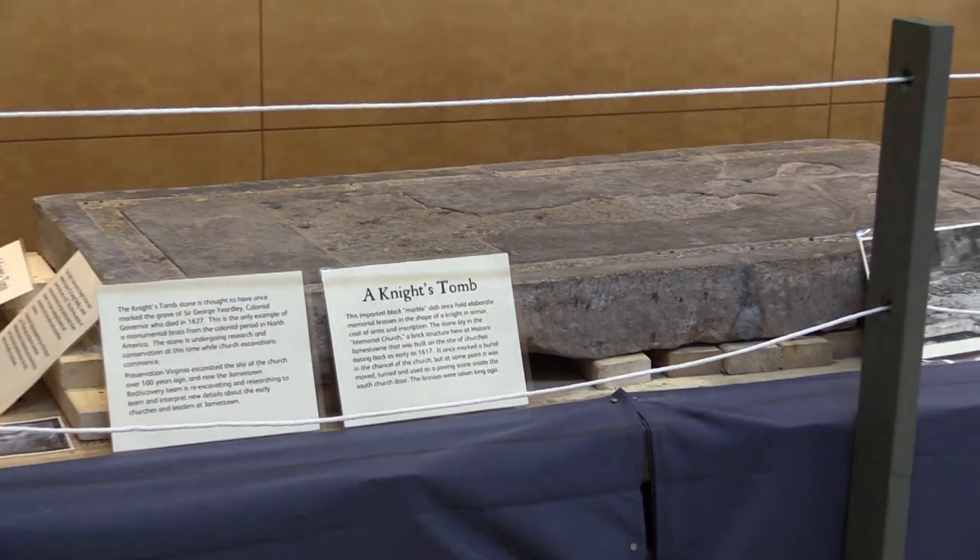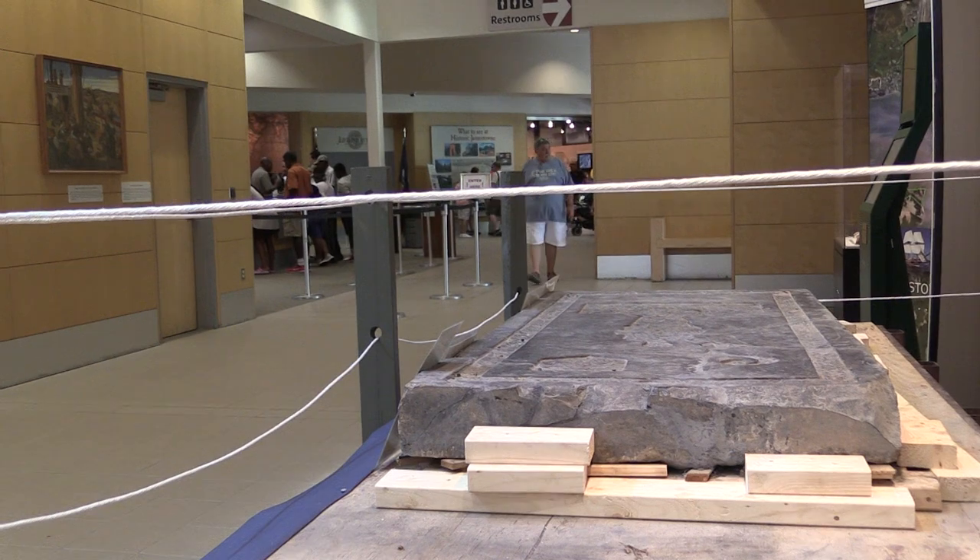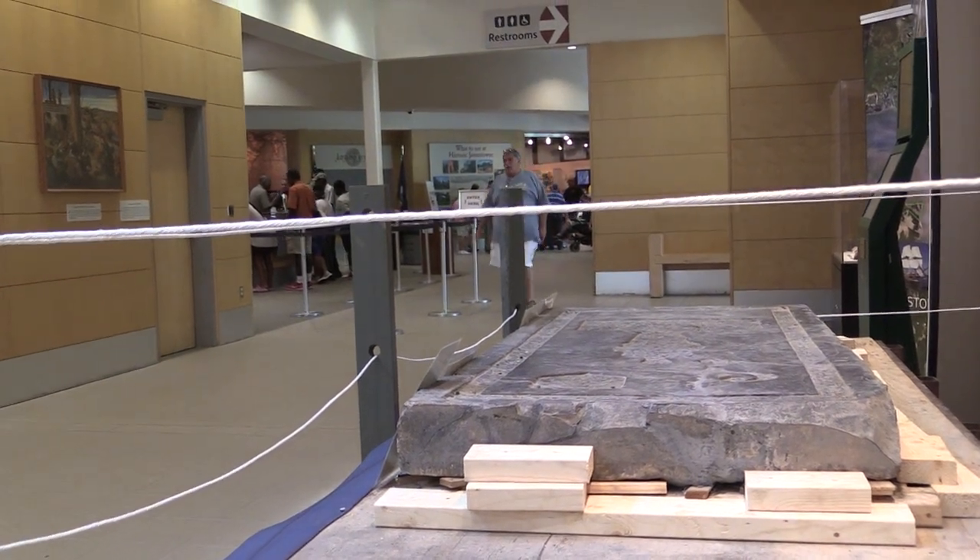I'm going to continue performing the infill process over the next couple of days, and then all these cracks and voids will be filled in and the Knight's Tomb will be stabilized. Staff are continuing to remove the varnish or surface treatment to bring back the original color of the stone. The tomb will be temporarily moved out of the church due to ongoing archaeology work and for safekeeping, on display at another location in the facility, with reinstallation expected sometime in late 2018 or before 2019.